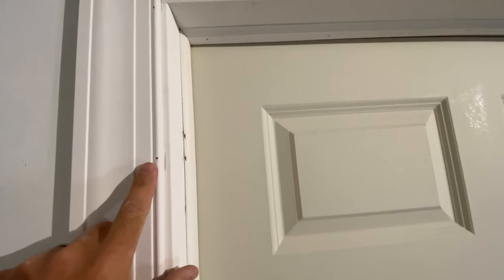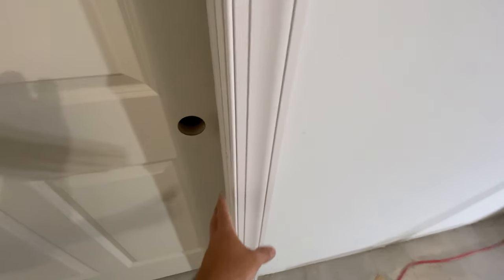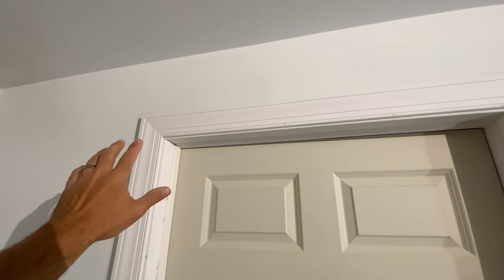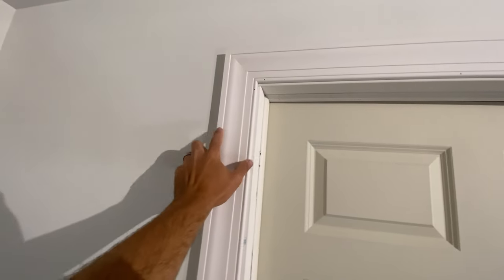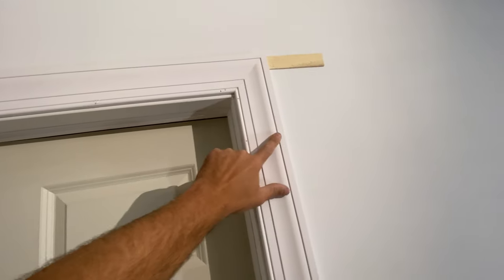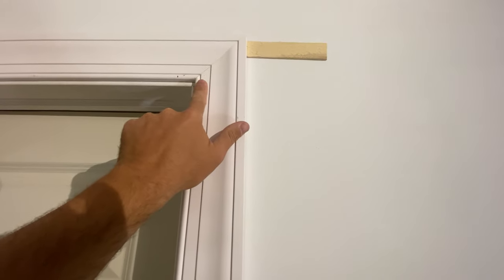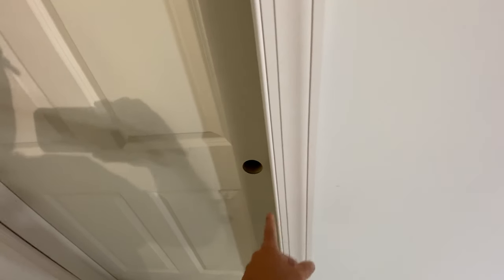I only have a nail here and a nail here on my marks. I'm going to let the rest stay the way it is — look at how far off my mark I am there, and it's kind of way off down there. These are just loose at the moment. I'm going to leave this set for a couple hours, do the rest of the doors exactly like this, and come back in a few hours to nail the rest of my trim off to the mark. Then I go around with a 16-gauge and nail around the outside of the door casing. What that does is you get your miter completely tight and let the glue set up so that miter is strong before you start moving it left to right — that's what's going to open up your miter. Don't rush on trying to nail those.